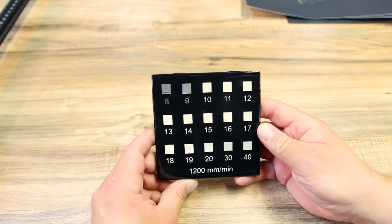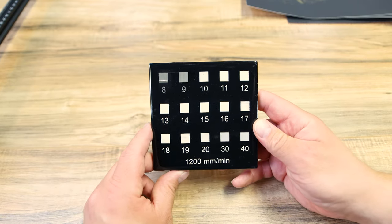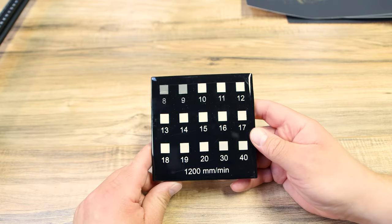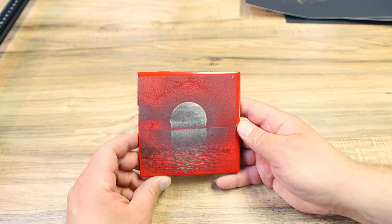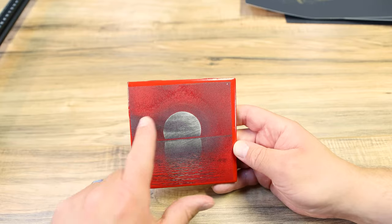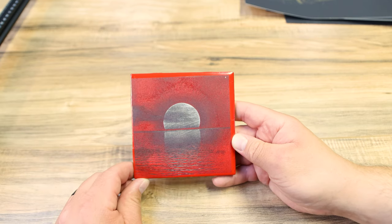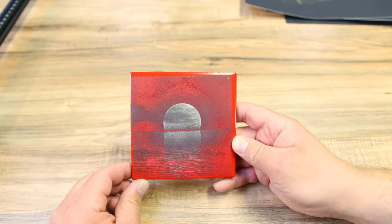Then I moved on to tiles and did one of my magic numbers tile tests — I'll link that above. In my opinion 15 was the best setting. I believe this laser can go much faster than 1,200 millimeters a minute so I'm going to adjust and see how fast it can go and still produce nice results. I also did a reverse tile: I put black down first, then red on top, and burned down through the black into the white of the tile, leaving some black for clouding. It came out like a sunrise over a lake — not bad at all, again without clear coat.